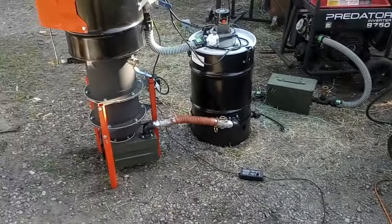And now another thing I like to check is just to see how dry the inlet is at the engine. So this is where tar likes to drop, is when there's a high pressure. Yeah, that's just soot. So that'll probably wash off. Alright, so I'm not worried about tar, so I'm going to let that cool. And we'll come back in a few minutes. It doesn't take long. I mean, if there was tar, it would probably already be a problem. I didn't hear any valve noise.